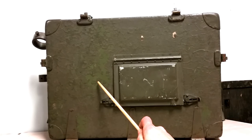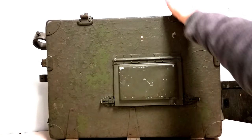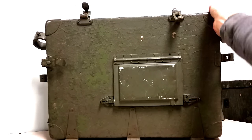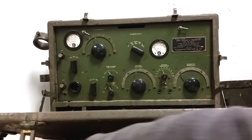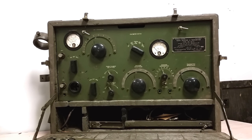You can see the outer coat is a little darker than the inner coat. We have a hatch here, which I'll get to in a minute. But let's open it up. BC-157A — nice tag, Continental Electric, roughly 1934. You can see 2.3 to 2.7 megacycles, one band. This actually is a receiver and transmitter, not a transceiver, so they are more or less two independent things.